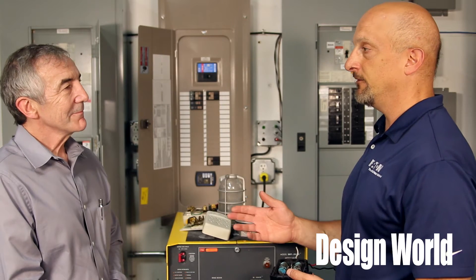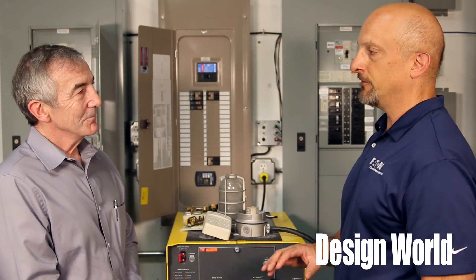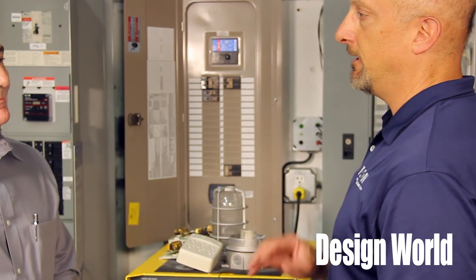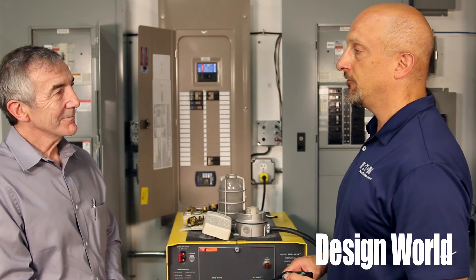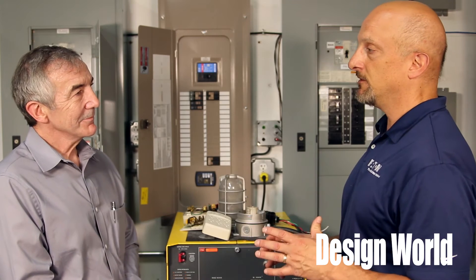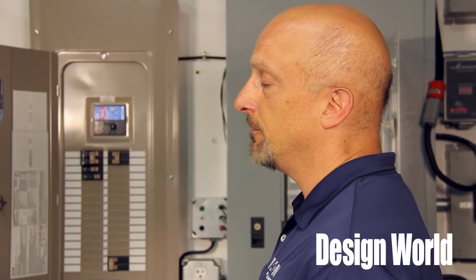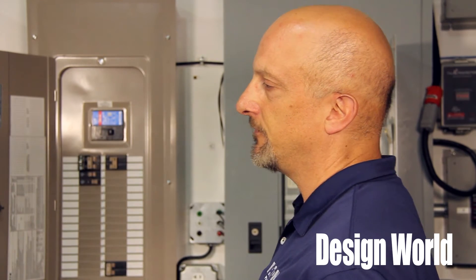On a commercial building, maybe you apply a 120-volt unit on a 480-volt system. Then these MOVs think they're supposed to clamp every single cycle. An open neutral in your house might produce 200 volts on half of your panel. They say the voltage went high, and start to get hotter and hotter — it's not a microsecond event anymore, it's many seconds. When they burn up, historically people have had house fires. New versions have internal fusing and other components to take the surge protector off before it burns. There are also high-frequency filters — so it's not just a clamp, it's also a sine wave tracking device that removes high-frequency noise.